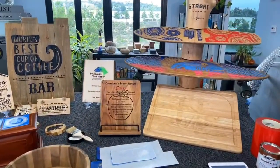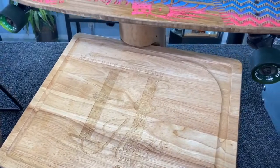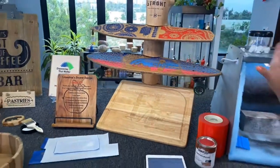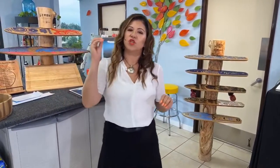Here are some samples of sand carving wood, applying photo resist and sandblasting. With sand carving wood, you have depth and detail with your photo resist film, but you also have choices in color — that's what is remarkable. You can get creative with color when sand carving wood. Yes, you can laser, but there are occasions when you can sand carve instead. Maybe you don't have a laser, or you want to add a color fill or work on an odd shape — you can sandblast it.